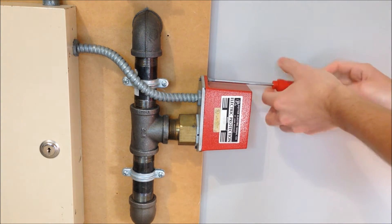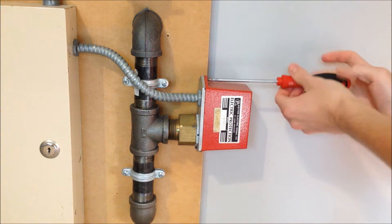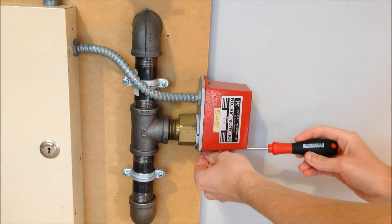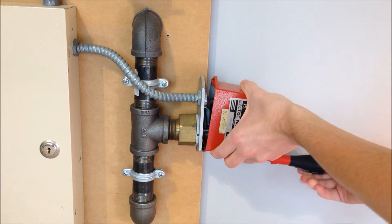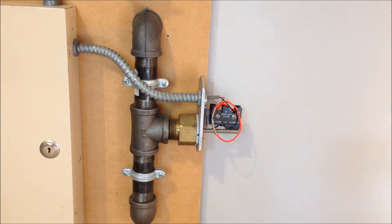Back in System Test 16 was the last time that I used this piece of equipment to activate the system. If you remember that test, there was a super long delay between when I activated this flow switch and when the alarm actually sounded. That's because this piece of equipment is wired into a poppet module on the DMP panel, so it has to wait for the DMP panel to report the alarm to the SXL-EX before the alarm will go off on the SXL's NAC circuits.